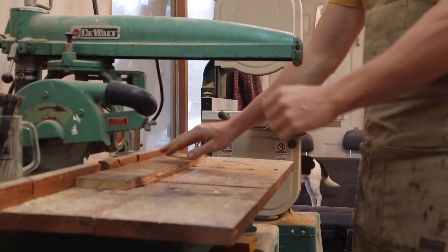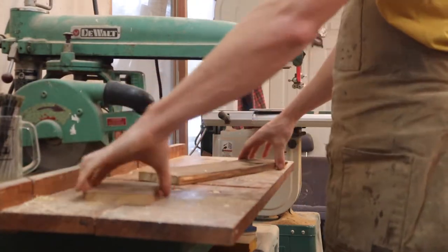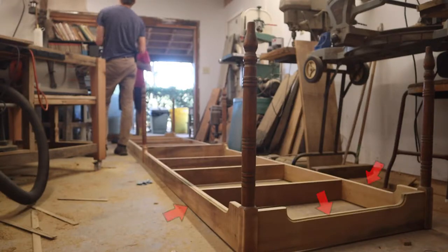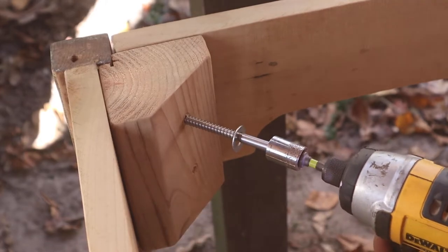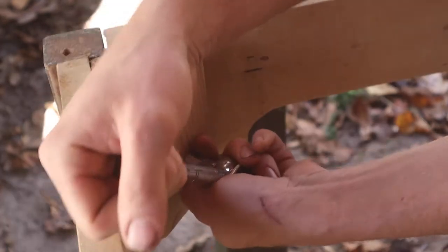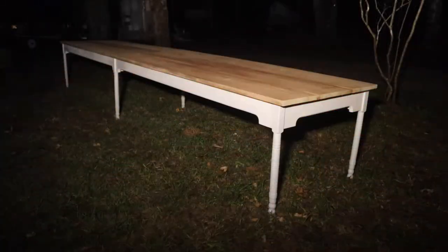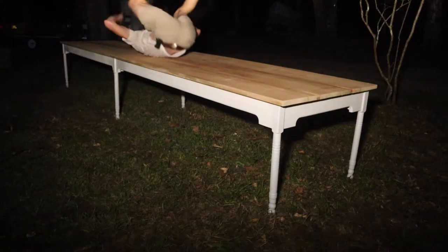In order to attach the legs to the table top, we have to build a base or an apron, otherwise known as skirting, which basically offers more structural stability to the table legs and to the table top — which in our case is a chicken coop. Here's an example of a farmhouse table I was building for Thanksgiving. The apron goes around and then there's the cross beams. The legs are not actually permanently attached to the apron — they get bolted in from underneath. This is probably the best way to attach legs to most tables: the hardware is hidden, it's very sturdy, and it allows you to take the legs off when you need to transport it. Admittedly, looking back in hindsight, that table was too long. Just make two eight-foot tables — it'd be way easier. Anyway, back to the chicken coop table.